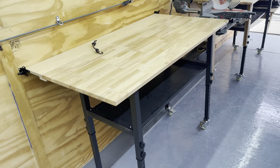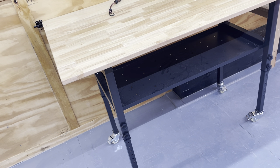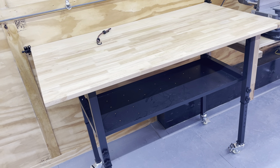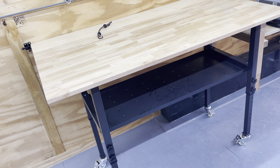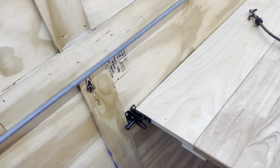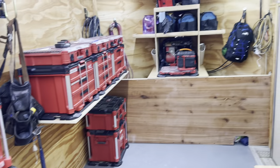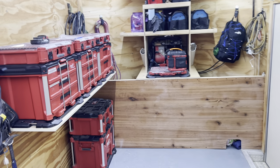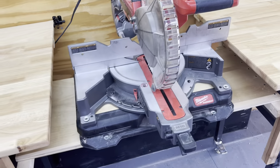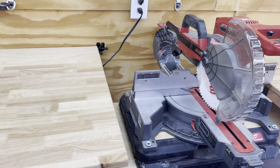On the left side is a mobile workbench I bought off Amazon. As a cabinet builder I could have built it, but buying mobile workbenches with casters and a butcher block top for under $200 each beat DIY-ing it for $150-200 a piece. There are two here and one more over there. We extended the backs with three-quarter plywood and joined them together. Everything — rails, counters, workbenches — is three-quarter plywood sanded and pre-coated with two coats of lacquer so it's smooth and won't splinter. Both the chop saw and table saw are mounted flat and level on top of the workbench so I can feed in a piece of trim and make my cuts.